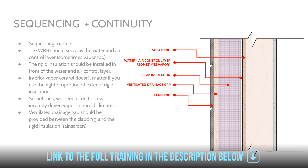This perfect wall is somewhat aspirational — there's a ton of variations of it. It's very expensive to install all of your rigid insulation outboard with no insulation on the interior, although it is preferable in certain situations. We don't want that rigid insulation to be installed behind the WRB; we want it in front of the WRB. So if condensation forms on the backside of the rigid insulation, we don't want it to migrate into the sheathing. If we had an airtight WRB in front of the insulation, we could see moisture accumulation behind the WRB around the insulation seams. We want that condensation to hit the surface of our weather-resistive barrier and drain down and out. We want our WRB to also be our air control layer, and we want the air barrier to be located behind the rigid insulation — this is very important.